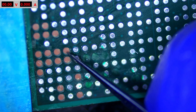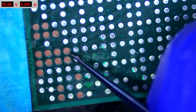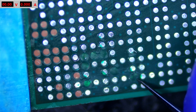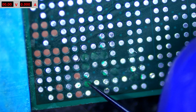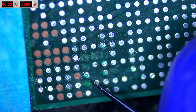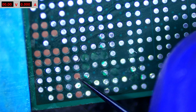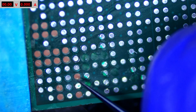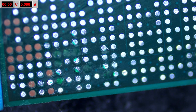I've covered a lot of these over here in solder mask. I scraped this one a bit too much — you can see on each one of these, this is actually ground, and then this here is where we actually need to solder the replacement pad. I made the mistake on both this one and this one here. You can see the difference between this pad and then the curved line in between them and that pad there, which connects to this whole oval here. If you're not careful you can kind of scrape through, and if you're putting a new pad on you can very easily accidentally short that pad to ground.